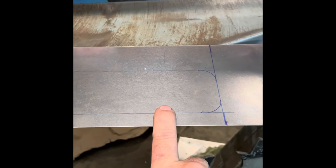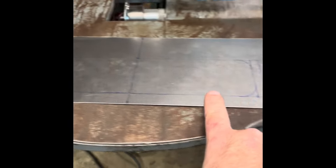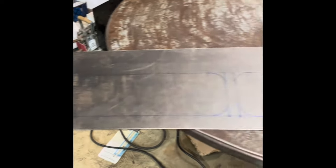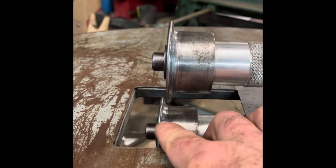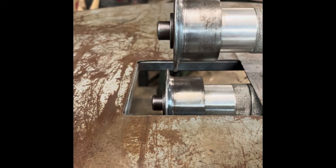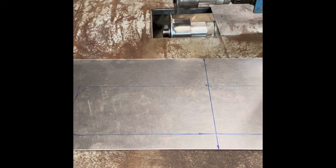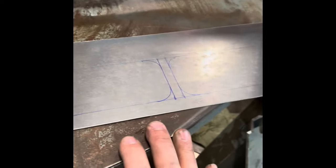The upper side of the cowling is damaged — they went and modified it and it's not right. So I've laid out three new vents for the top of it. They need to be a flange, so we're going to start this in the bead roller. I've laid out all three openings and I'm using these dies — normally a tipping die with a backstop — but I can also use them to do steps. I've got about a quarter inch of spacing because I want about a quarter inch of flange. I'm going to bead every one of these as a step first, then we'll tip those edges up and create a nice reproduction of what the upper cowling should look like.